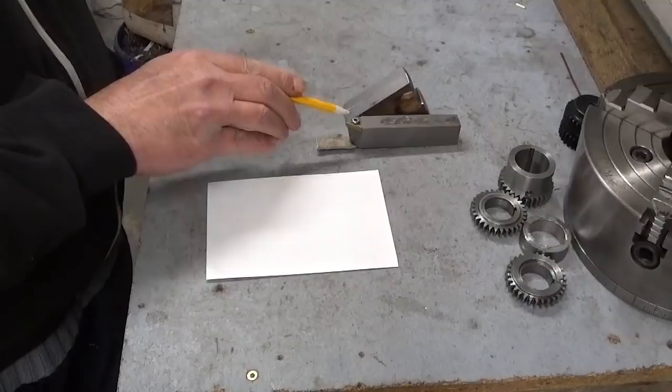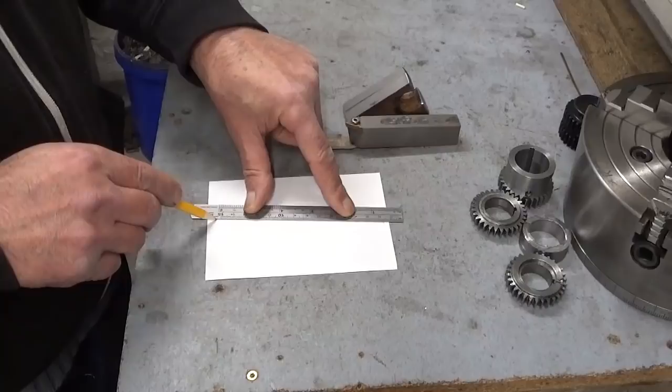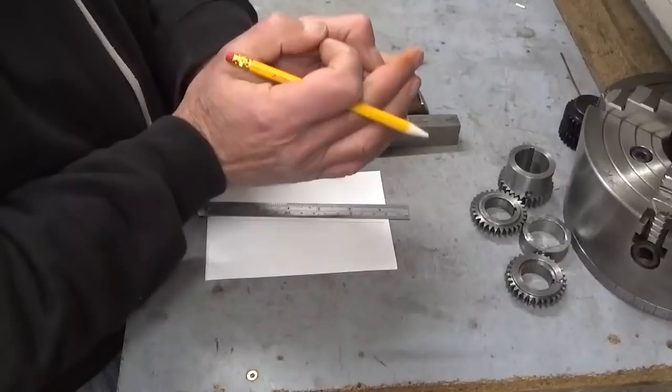If you use a cutting tool that has the correct geometry and the right cutting speed, the right depth of cut and feed, it should sound like this, which of course in this part was absolutely not the case. You can see in the slow motion that the chip is pushed, all the material is really squeezed into each other, and it's not making a nice and curly chip as it should be.